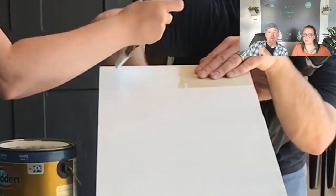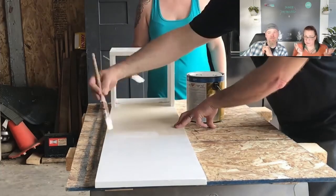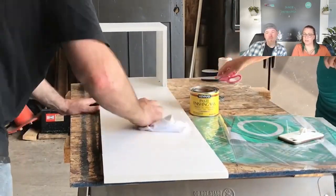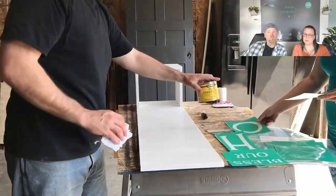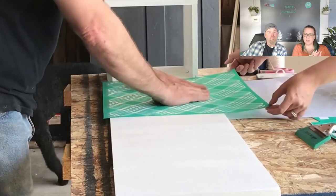Get everything painted up with exterior paint - be sure to watch where you put your hands when your painting partner's got a brush. A couple coats of exterior paint in whatever color you like to work with your design. Then we always put finishing wax on painted surfaces - it gives you a smoother surface to work with, makes sure the stencil doesn't extra-stick, and it's good anytime you use wood with stencils. Even if you're using a Cricut, it'll keep it from peeling up the paint from sticking too hard.